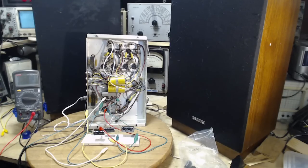How could hooking up a receiver possibly kill the hum here? I can't see it. Other possibilities of a hum. Oh boy. Well, I should give some thought to that. Other sources of hum. One of the last receivers I did, it turned out a terrible hum was due to a poor grounding at a riveted terminal.